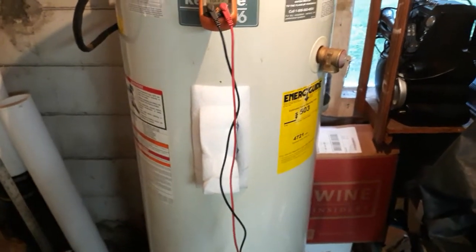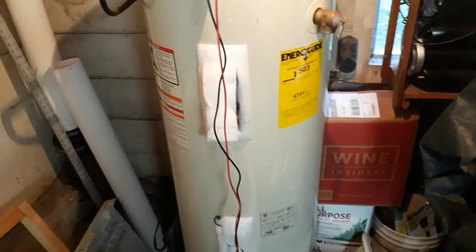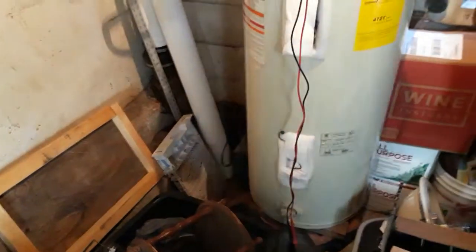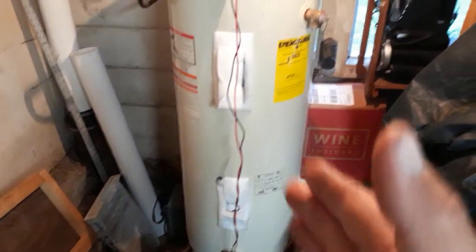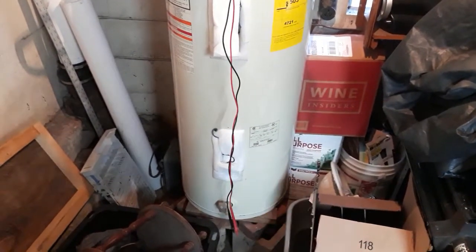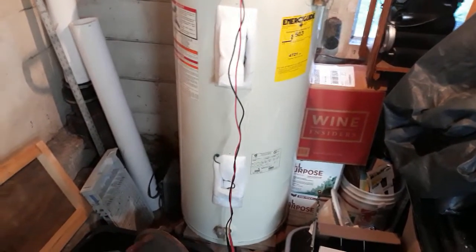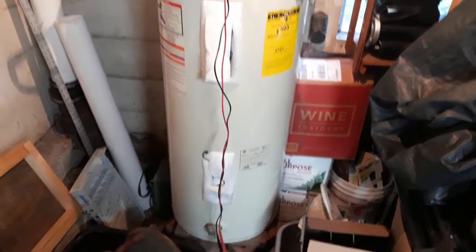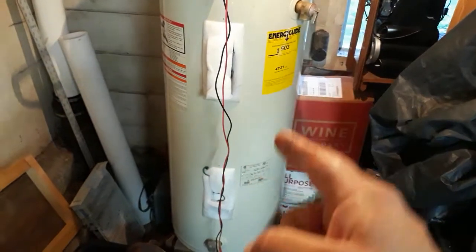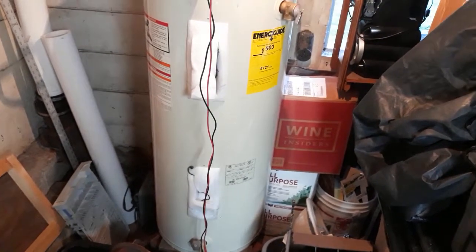Hey, what's up YouTube. Today I just wanted to make a quick video to maybe dispel a little confusion about dual element water heaters. Mine was acting up a little bit and since I had the covers off, figured I'd show you guys what I'm talking about. I know some people who have a good tall water heater, 40 gallons maybe 50, but it's only got one element at the very bottom and that thing has a horrible recovery time. You use up the hot water and you're looking at at least half hour or more before you're going to have anything, because that element has to heat all of this water and relies on natural convection to circulate the heat. It's very inefficient and it really sucks up your power bill.